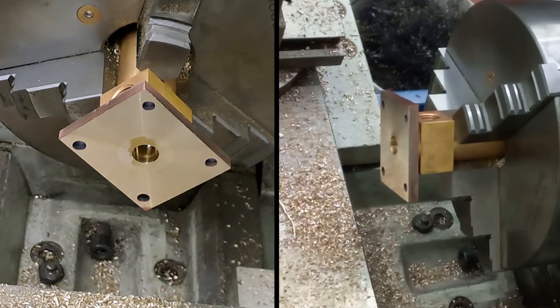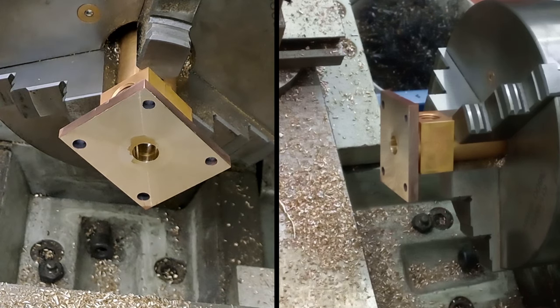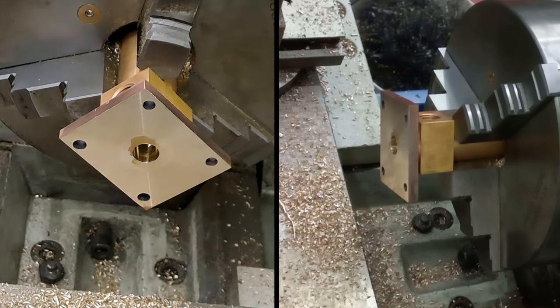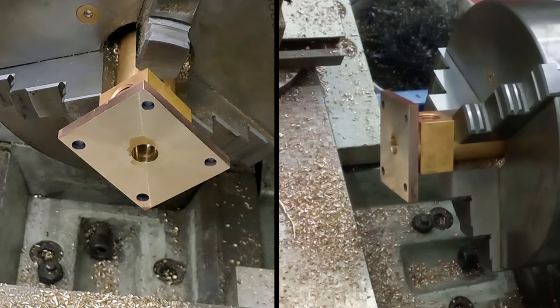That's the 12mm. Again, across to the bench, pick up the right drill. This is a 12mm. Now, get this into the drill chuck again. This will be the last one. It's the biggest I've got. Anyway, I don't have a 12.4 or 12.5. And then we can get the reamer in. We'll slowly lay the right one down. Machine reamer. There we go, nice and tight.